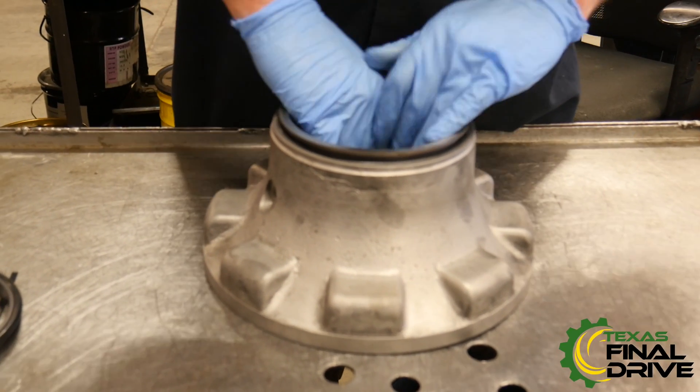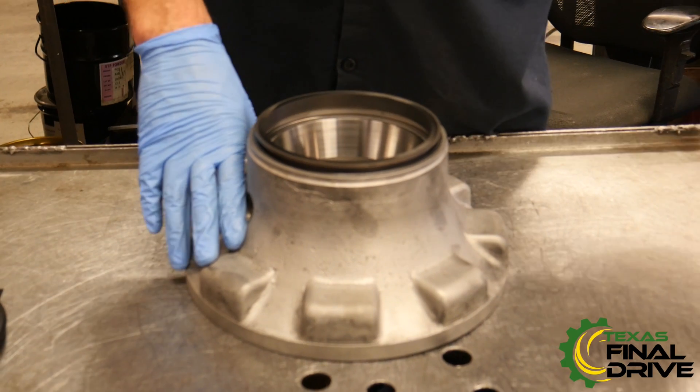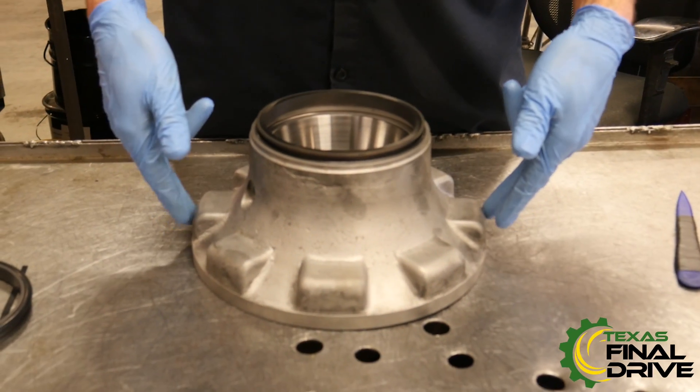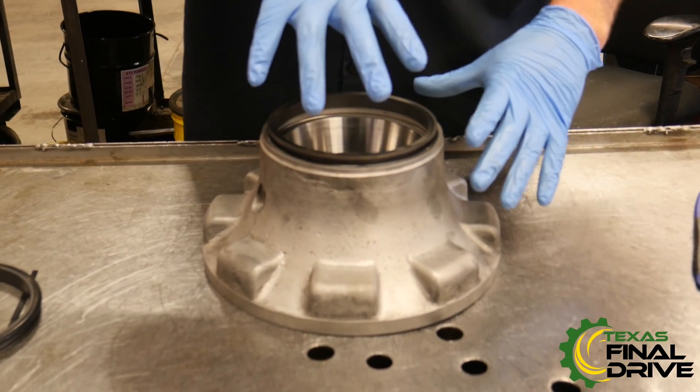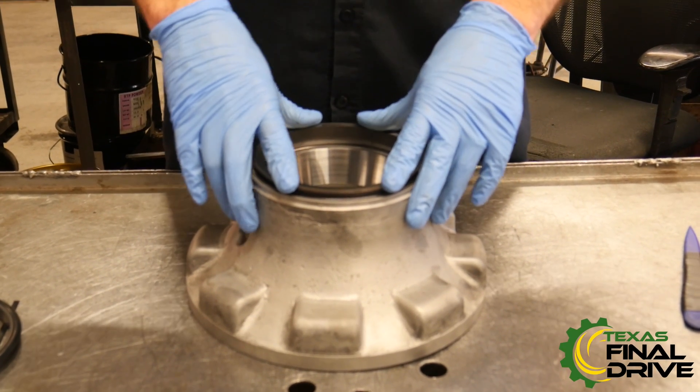You're going to have to have your drive most of the way disassembled to get to this part. You can leave your main housing and your brake housing together if you have the right tools. But you're going to have to have your axle and your hub separated to get to your face seal, otherwise you're not even going to be able to see it.